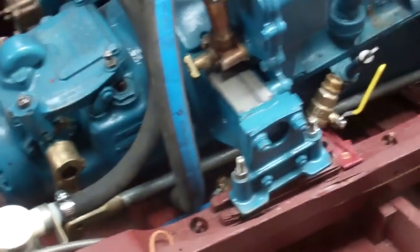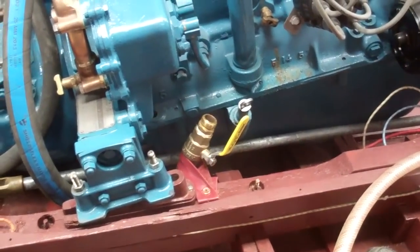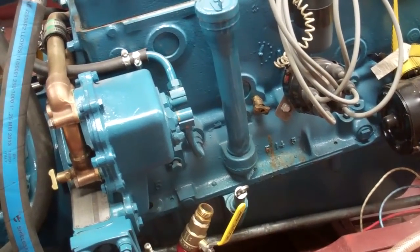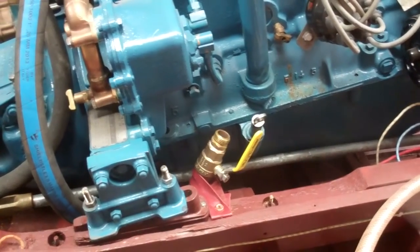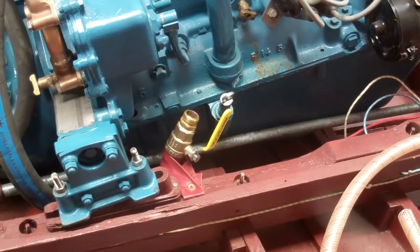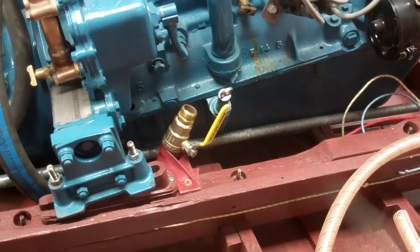The toughest spot was figuring out where to cut the hose and you just put it within the system. A lot of engines actually have the water pump right here, so your water intake comes over, goes up to the sea strainer and across and into your water pump — all a lot more easily accessible versus this one with the water pump in the back. The nice thing is with this clear hose we have selected, owners will be able to observe the antifreeze flowing into the engine and eventually out the exhaust pipe.